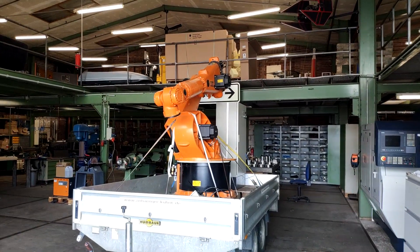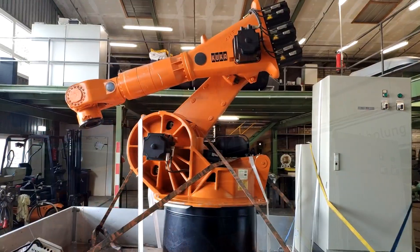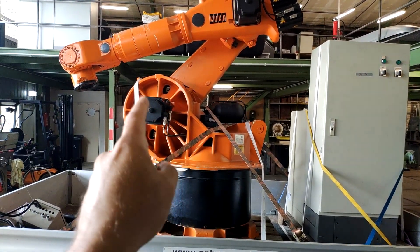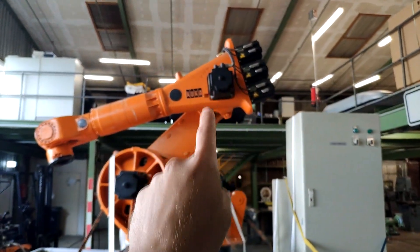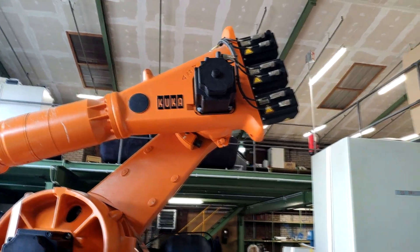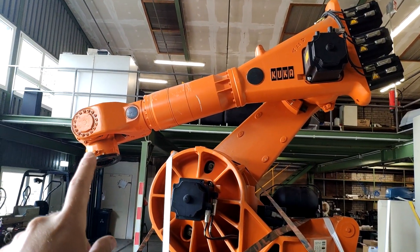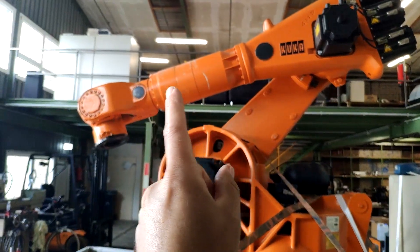Let's crack open the switching cabinets, have a look at the license plate and see what we've got. This robot is a KUKA and it seems to have a six-axis configuration. A1 is the swivel base, A2 is the main arm — that pivot point. Then there's A3, another pivot point up there. All three of those control the front unit, where there's one rotation, a second rotation, and a third rotation — that's A4, A5, and A6.